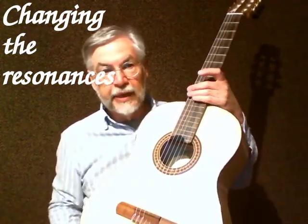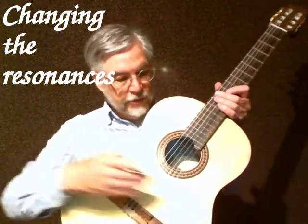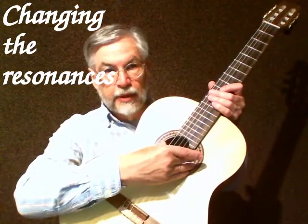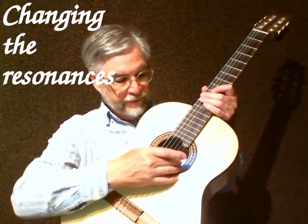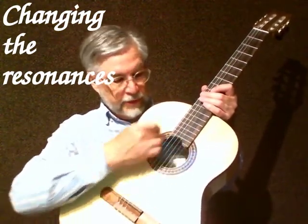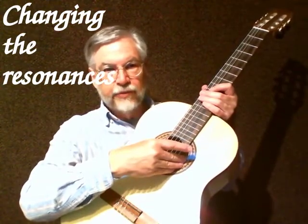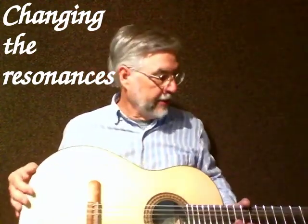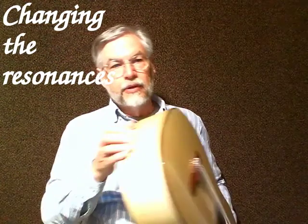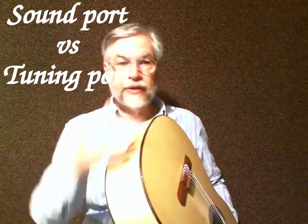The same thing is true of the back. For the air resonance, there are a few ways to change it. You can increase or decrease the size of the sound hole. It's helpful to leave a little bit of wood — maybe a quarter inch — on the inside of the rosette so you could potentially sand that away to make it larger. It's more difficult to add that after the fact and lower the air resonance. But there's an easy way to raise the air resonance: come to the butt end of the guitar and drill a small hole there. That will raise the resonance of the air inside the guitar.